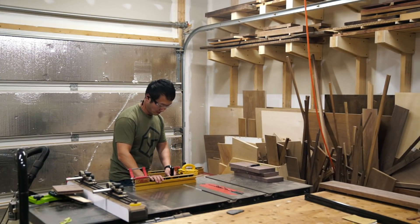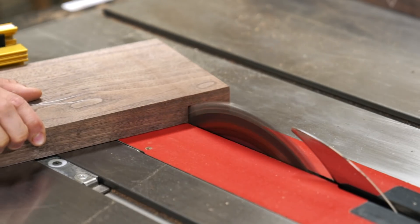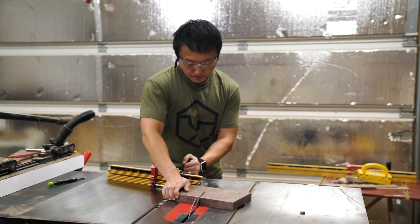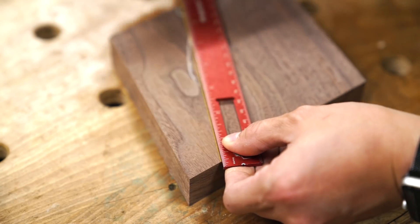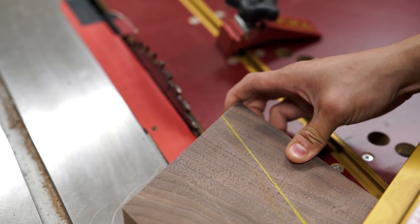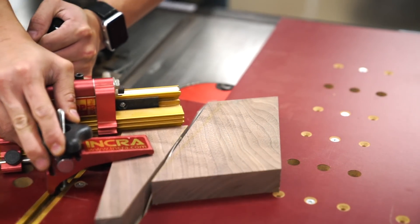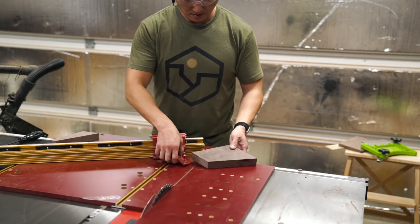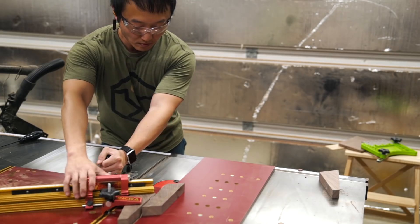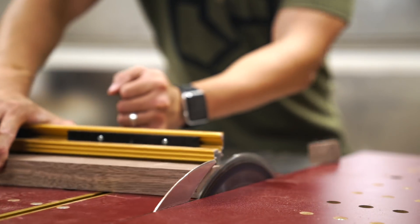With the top set aside, I began to work on the legs. I set my miter gauge to make a cross cut at 15 degrees on both ends of the stock — this will be the angle that the legs will stand at. Then I laid out a taper going from 1 inch at the bottom to 3 inches at the top, and lined it up to the edge of my cross-cut sled to make the cut. I needed to use my sled again to make a 15-degree cut on the ends of the two stretcher pieces to match the outer angle of the legs.